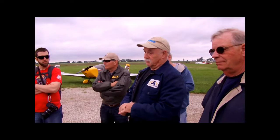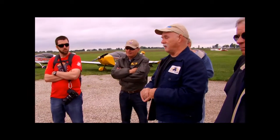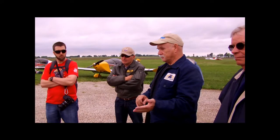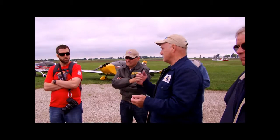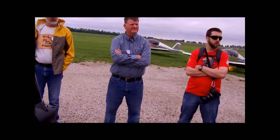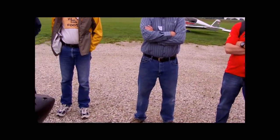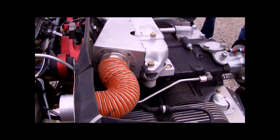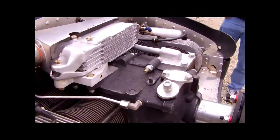Fuel flow — naturally, if you're going to make more power, you're going to burn more fuel. Nothing's free. On takeoff, the factory recommends 40 inches maximum. I use 42. 42 inches gives you roughly 5 psi, which to me is a safe number — I've got a blower on all my vehicles and 5 psi seems to be okay with any stock engine. You will need to add fuel to keep the heads cool, which is what affects your fuel burn.